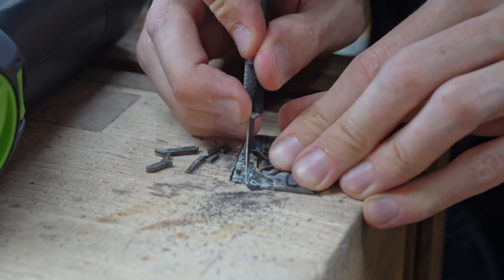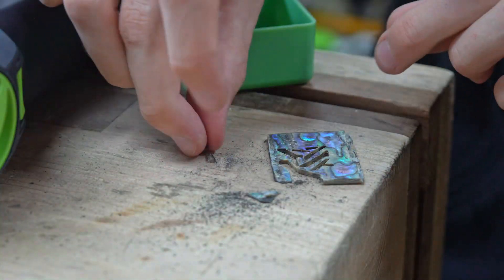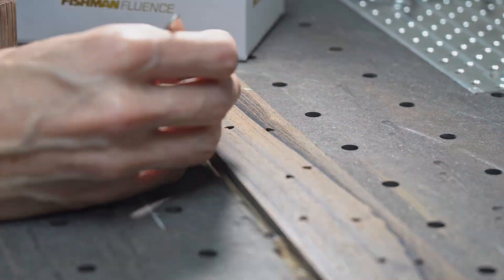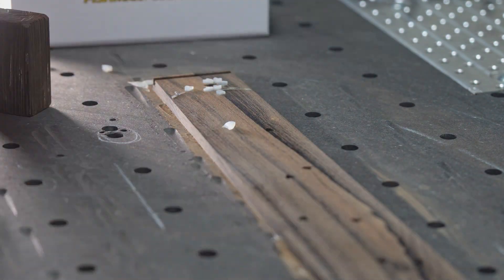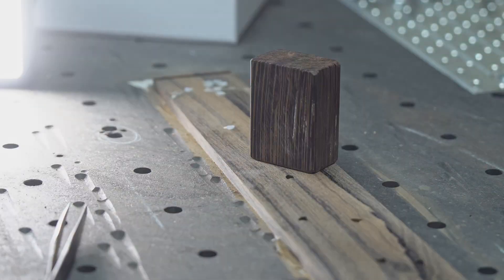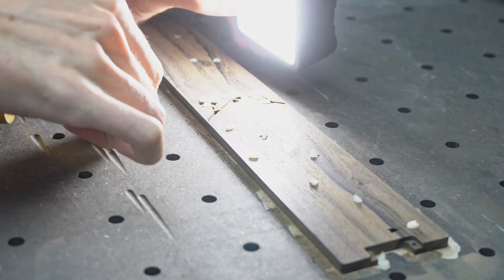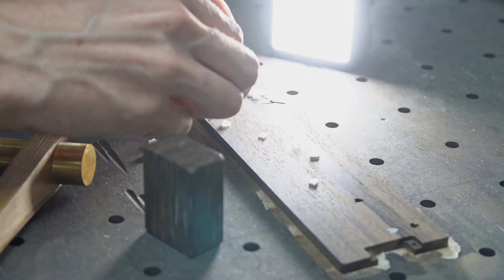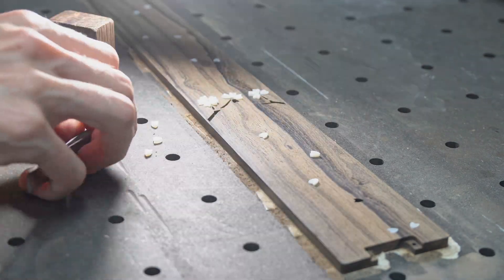With all the pieces cut out, I cleaned them up and made sure all glue residue was gone, then it was time for assembly. I cut the pieces to exact size without applying any offsets or making the inlay pieces smaller, which was a bit tight. They all did fit in but I had to use quite a bit of persuasion, which caused some of the abalone pieces to break slightly. I still got it in and because it is tight you cannot see any of the break lines. In the future I might make them ever so slightly smaller — maybe a 0.05 millimeter offset on each side.